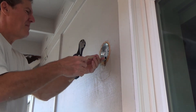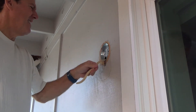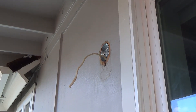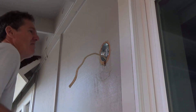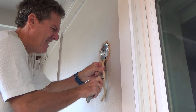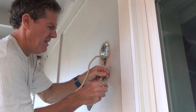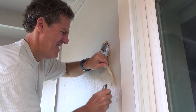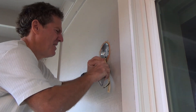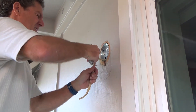Then I can strip this and I have to decide how much to strip. I can strip it from there. I'll get my sheetrock knife out — some people would frown upon this, but if you watch any electrician they use a sheetrock knife to score this, just scoring the outside sheathing. I'm trying not to go too deep with it. I guess I have to go a little bit deeper so I can peel this off like that.